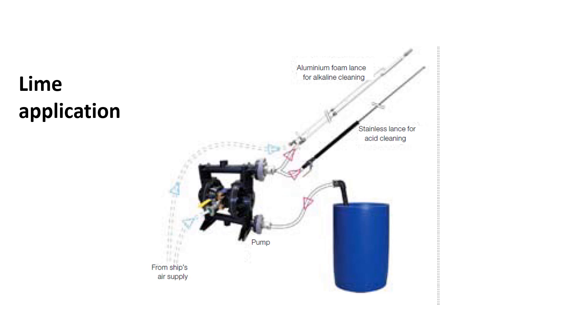The mixture is to be applied with a roller or a spray to a height as calculated by the stowage factor of the cargo. A thicker coat is then applied to those parts of the hold lacking good paint covering, such as the tank top. Special attention should be paid to areas behind the frames and to inaccessible places — no bare metal should be visible. Sometimes a second coat may be applied; if during drying rusting is visible through the lime wash, this may stain certain cargoes. To remove it, use high pressure water washing and possibly caustic or citric acid cleaning chemicals. Regarding hold block, the shipper should be consulted for the application rates, which depend on hold condition, and the hold block is easily removed using the manufacturer's hold wash.